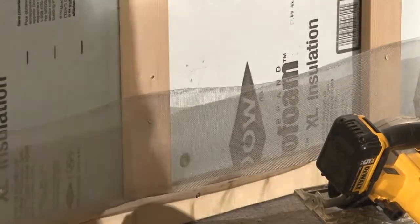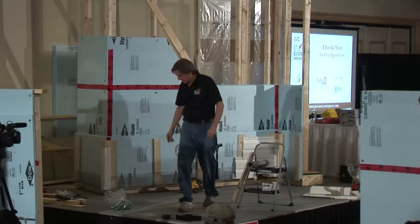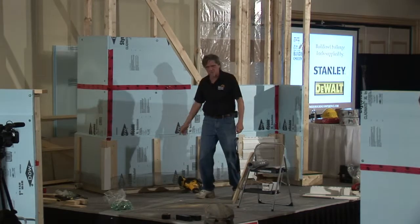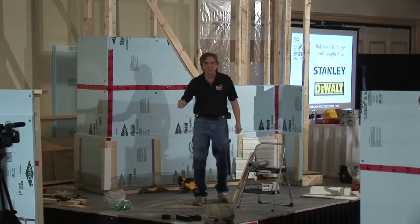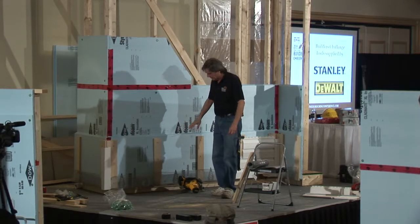And then we've got some nails. We don't have a lot of them. I've got them on the front here, they're actually vinyl siding nails that you can use to tack on your screen. In fact, on the site, we'd usually do it with a stapler and just staple them in. That would hold it in because the siding goes on top and holds everything down.